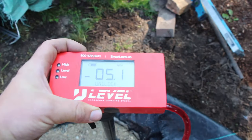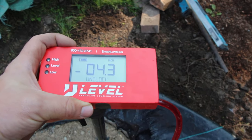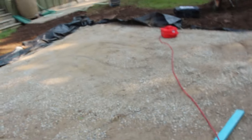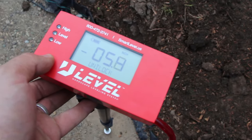I can do the same thing down this end — this is 18 feet, so that's more like four and a half inches, and I'm pretty good within that range. Coming down to the diagonal point, we should be around five to five and a half inches, and we're right around that area. With that, I know our corners are good and following the right slope.